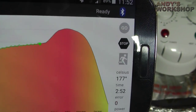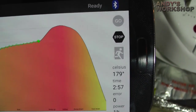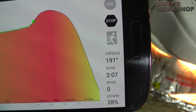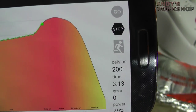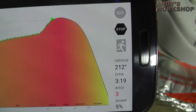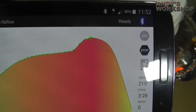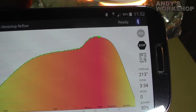Let's see what happens when it gets to the ramp-up stage — this is where the solder is melted and we're going into what's called the reflow stage. You can see the power there; it'll need to ramp up here. We still haven't had to go anywhere near 100% — I saw about 60%, maybe 65%. The oven is just nudging the power to go over the top. Now here comes the problem: I can't vent heat from this oven — it can only cool naturally. So I'm going to have to lift the lid to vent heat. Let's see how well it loses heat naturally first.